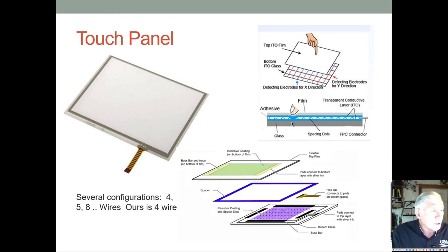Now, you're not running a voltage, you have 3.3 here, ground there, but on this one you're not putting any. You've got the GPIO pins connected to it tri-stated, so they're floating, and then you hook one of these sensing pads up to your A to D converter. Because there is a little bit of resistance from where you make that touch on the bottom pad too, but because the A to D converter is very high impedance, there's very little voltage drop across that, because there's very, very little current running. And so it gives you a pretty reasonably good measurement of this top panel.